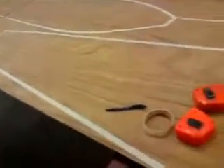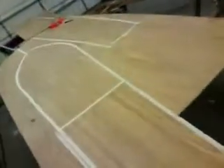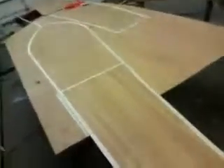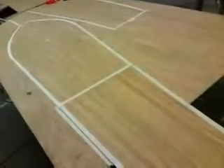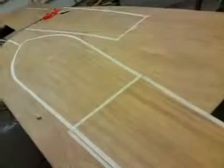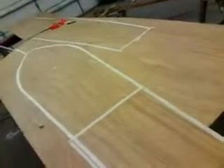I'm going to paint it so nobody's going to see that part, or the cockpit sole. This is a rough cut taken from measurements off the drawing that we've got laid out on the strongback. The only part of the boat you're actually going to see is going to be the bottom. I have two quite irregular pieces of plywood, and since I'm picky about it, I wanted the grain to line up, which took a little hunting. This mahogany is very much like redwood, and you have to be very careful about the direction you approach sawing it, or you're going to tear pieces out in the good piece you want to save. You have to continue to try to cut downhill with your saber saw when chopping these pieces out.